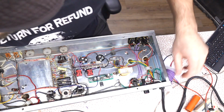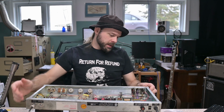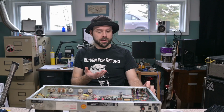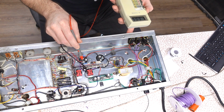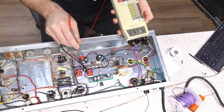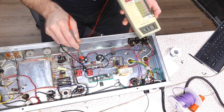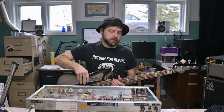Dual rectifier. So theoretically, if we turn it on with it in the tube mode, nothing should happen. But, 515, 516, that's working. Standby will turn this off. Yeah, there it goes down. Flicking the rectifier should shut it off. Slower though. But it should work now. Let's test on it.